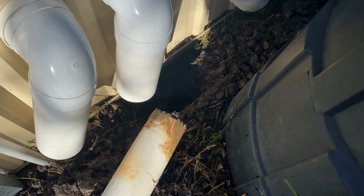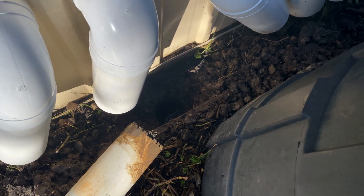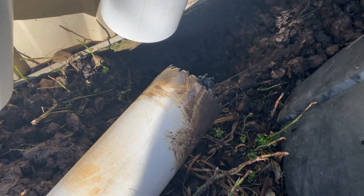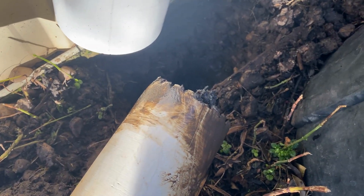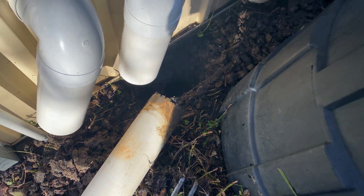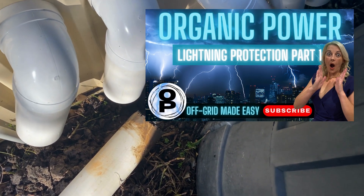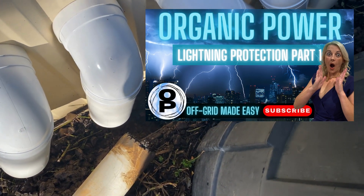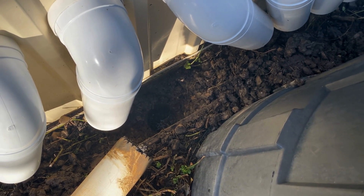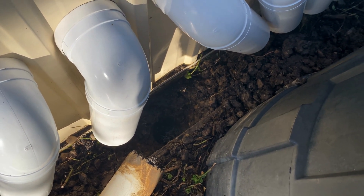This is going to be the position for my grounding stake for the surge devices. I'll cut that hole with my homemade cutter — just a bit of PVC pipe with some teeth cut into it. You can check that out on the lightning install videos to see how we've done that. I'll add some water to the hole and twist that around cutting down through the earth, then add bentonite around the electrode once it's in place.